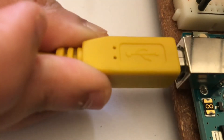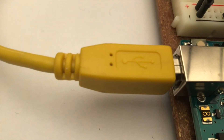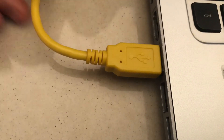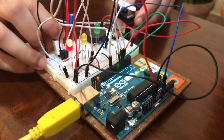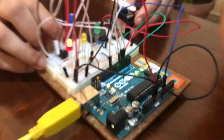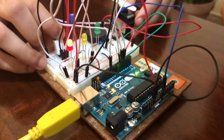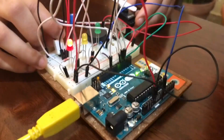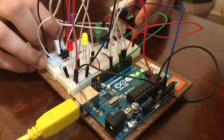Then attach the USB cable from the Arduino Uno to the laptop. The code that you will have to type on the laptop will be in the description below, so use that for reference. Now let's test it out. When the piezo is pressed against a flat solid surface that can vibrate, like a wooden tabletop, your Arduino Uno can sense how intense a knock is. The LEDs give you a status: the red LED indicates the box is locked, the yellow LED indicates the box is unlocked, and the green LED lets you know if a valid knock has been received.